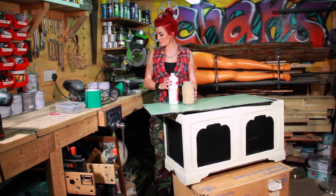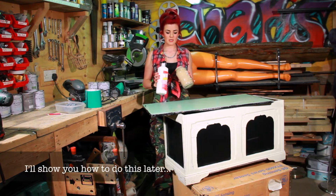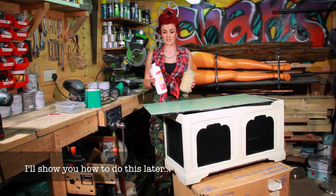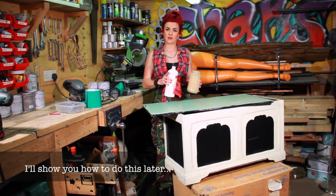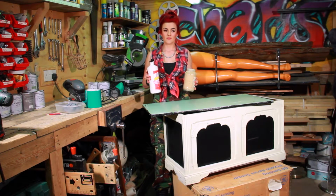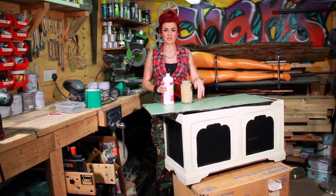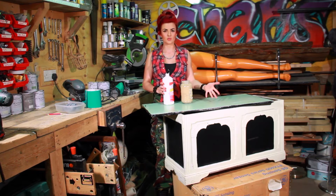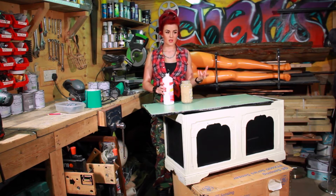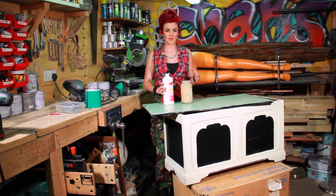So I would just buy a filling knife as well from your local DIY store and start mixing this stuff yourself, because it comes in really handy. Bear in mind that depending on the wood, some woods are darker, some are lighter, so if you want to wax the thing afterwards and you're not putting something in the holes like screws and it's going to be visible, say you've got a hole in your tabletop or something and you want to do this, you need to use the same wood, so keep the shavings from when you sand it down for when you need to fill it, okay?